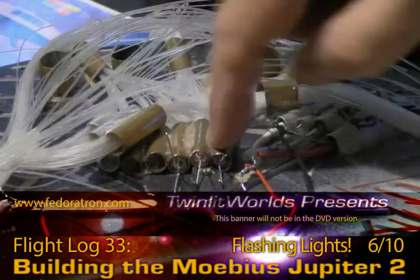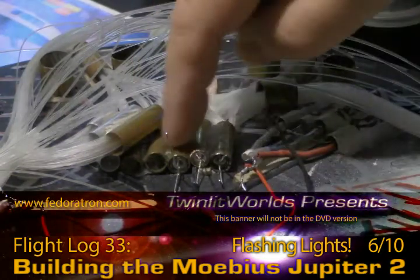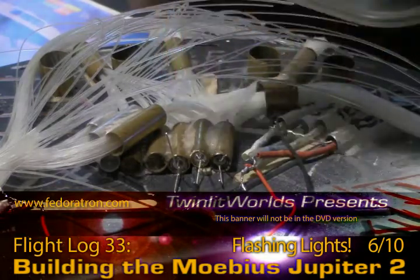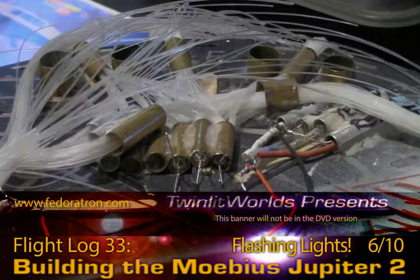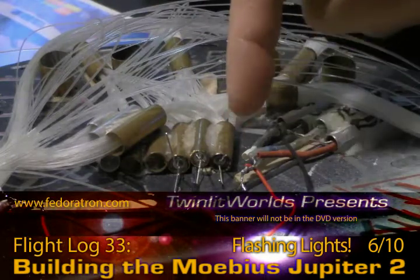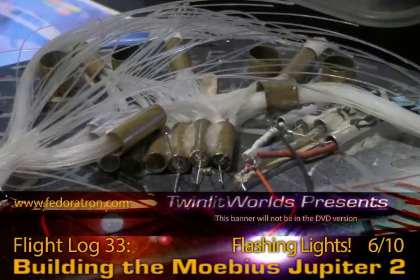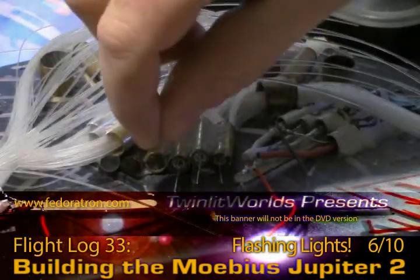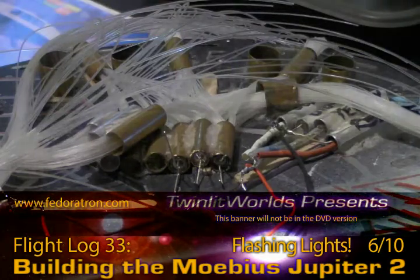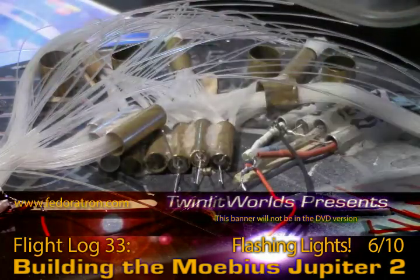I have installed the three cool lights — there's room for three more which I want on a different sequencer. That leaves a fourth color, so these are going to blink three and then there's going to be a dark spot. I'm going to have this one fill that dark spot. You could use that as a timer — if you don't want certain lights to come on for a very long time, you could put your reset way off at pin seven when you're really only needed at pin four to get that extra time delay going. I dropped a drop of super glue just to hold those in place — if they die I've got to replace them, so I don't want too much glue, just enough to keep them in place.